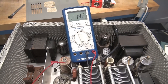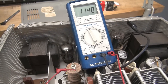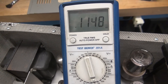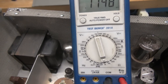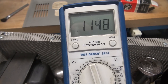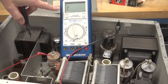Let's search for that high voltage short that's blowing the fuse on the Viking one when I flip on the plate switch. We know the filament circuit and the low voltage supplies are okay, but something is shorted in the high voltage. I have a meter looking at the plate of the output tube to ground — I'm measuring the resistance and seeing 0.1148K on this auto-ranging meter. That's pretty low. We know this cap down here has a big black mark on it, so I'm going to cut out that cap and see if the resistance problem goes away. Short's gone.